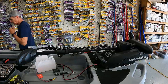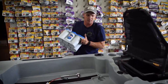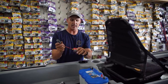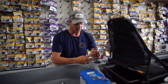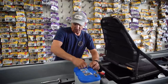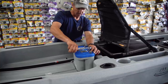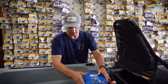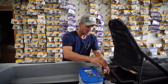Trolling motor's on — moving on. Now I'm going to put my battery in here and see if that trolling motor works. I've got me an Optima Group 27. This is the plug that comes with the kayak — you'll notice it's got a breaker in it; that's very important. Red to positive. It's also going to be important to cover these up — be sure you don't get a wrench that's too long and arc those. I did that one time and it lit up my tungsten ring; that's why I no longer have a tungsten wedding ring. I'm going to get some covers and put them on.